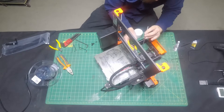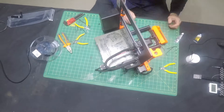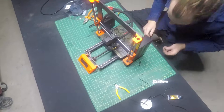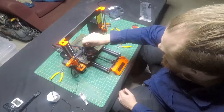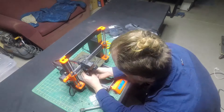The second part of the repair was actually from early on. I must have had the Z-height sensor collide with the print — whether that was because the print was peeling up or for whatever reason, the print had failed. I'd reattached the probe since then, but it was not completely vertical, and I think that was causing issues as well. So now I've reattached that with a little bit of extra structural integrity in the form of a 3mm bolt for some triangulation, and that's all epoxied together.